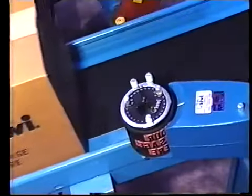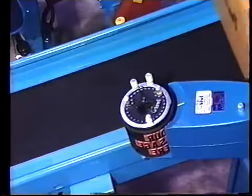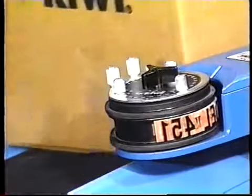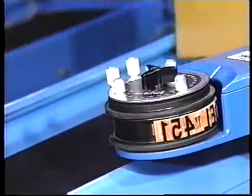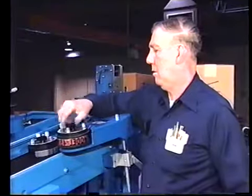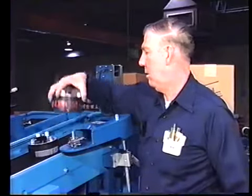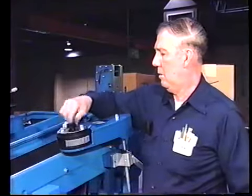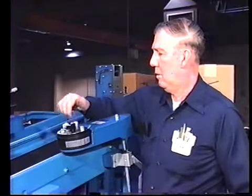The leading or starter bearing provides a positive start of the marking wheel. When the two anti-repeat rollers leave the case, the marking wheel resets to its starting position. After loosening a knob, the marking wheel can be quickly removed. This feature permits instant message changes by changing the marking wheel assembly.